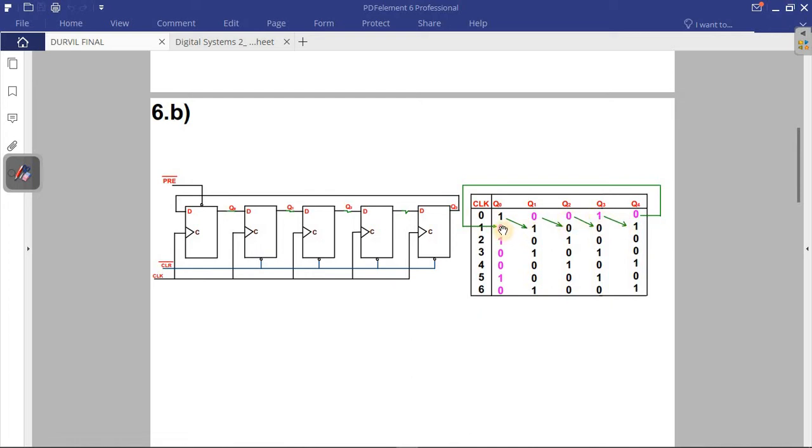When you shift, this position will be empty, and the last digit from the ring counter wraps around and closes back to the first position. If you shift again, the last value comes and closes there. That's how the ring counter works. They say six clock pulses, so you stop at number six.